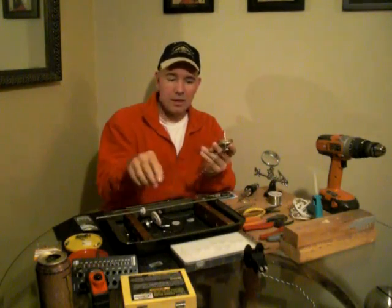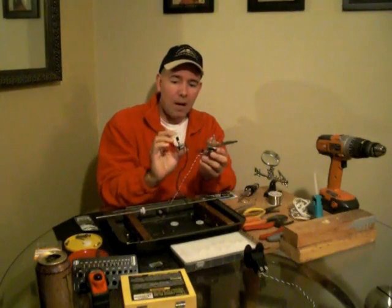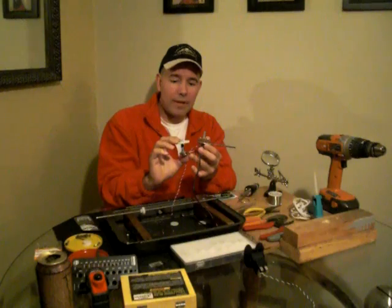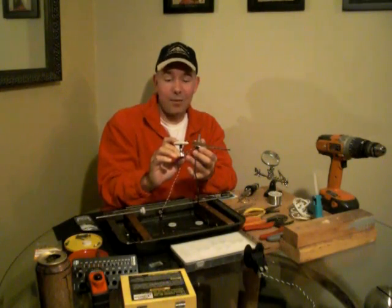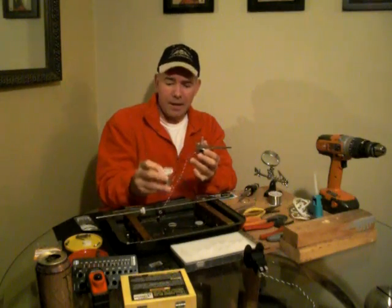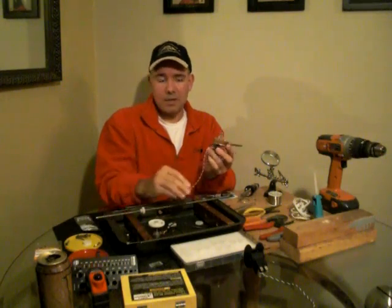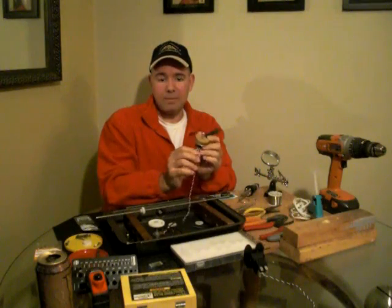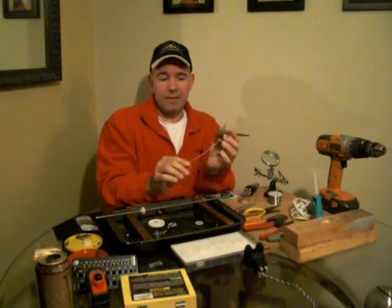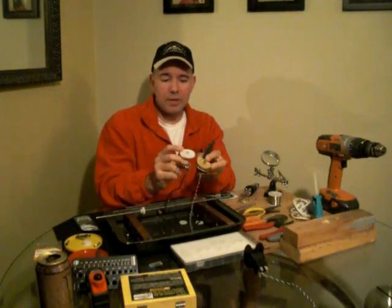On a potentiometer like this, for the speed brake lever and this one for our trim wheel, I went red all the way on the right, white in the middle, and ground on the left. I don't think it has to be any specific order, but I like to keep things color coded and organized, so I did it the same way with this one — red on the right, white in the middle, and green all the way on the left. So these two pots for the trim wheel and speed brake lever are done.